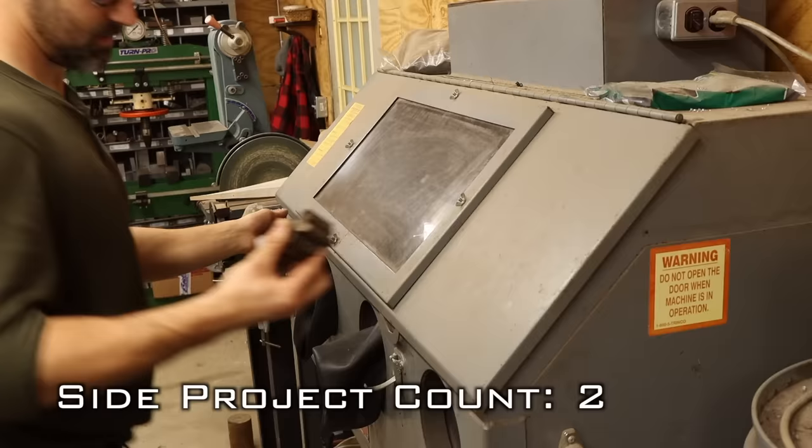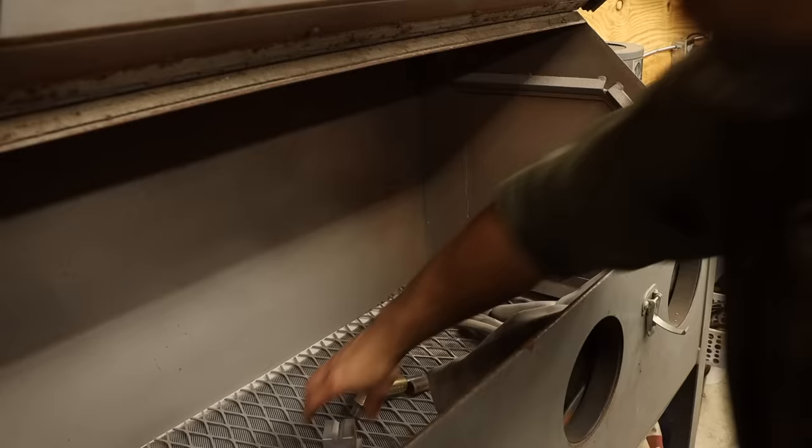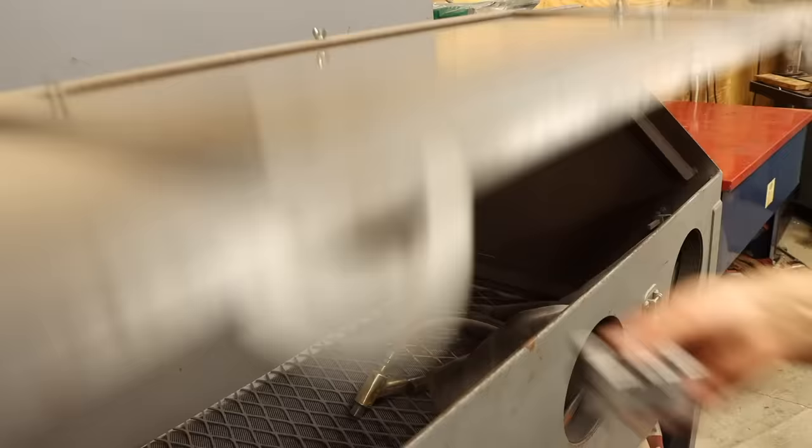Time for plan B. I wouldn't exactly recommend sandblasting on high precision parts, since this does induce stresses in the surfaces. Considering the neglect these blocks have seen though, they will likely need to be ground in again anyway. But that's one side project I'm just not in the mood for today, and these are more than acceptable for what I need right now.